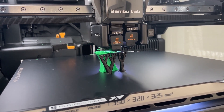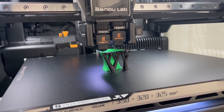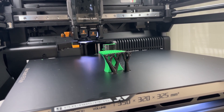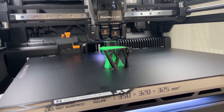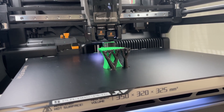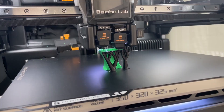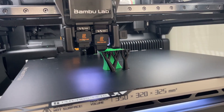The other improvement I was looking for in a new printer was multiple nozzles. The advantage of multiple nozzles over just a single nozzle with AMS is less purging between material swaps and, more importantly for footwear applications, better multi-material capability given different materials can have dedicated nozzles. One instance where this comes in handy is supporting heel, wedge, and platform component overhangs — the component itself can be printed in durable PETG while supports or just support interfaces can be printed in PLA so they can be easily and cleanly removed. But the use case that interests me the most is supporting flexible filaments, which can help with fully 3D printed shoes. This simply wasn't possible with the X1C given flexible filaments jammed the AMS.